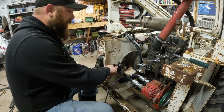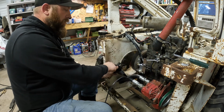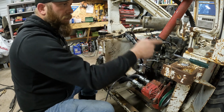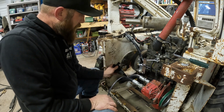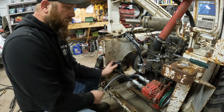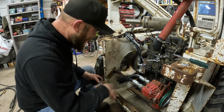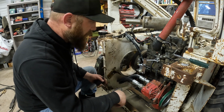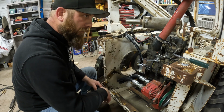So it'll sit like that. This will be the inlet. So the radiator will sit up here. Water will come out, go in the pump, out of the pump, around the motor, into the engine. So throw that on there, and we're just going to wire this in with the fuel pump. So when you turn the switch on, they both fire up right away. So I'll get this mounted, wired in, then we can go about mounting that radiator.